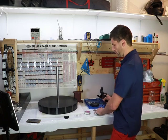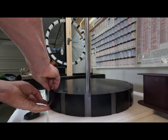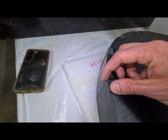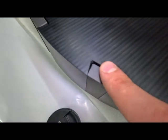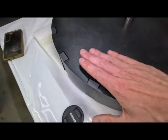It's actually harder to find 3 by 1 inch by half inch magnets than you'd think, so we'll likely have to go the custom route — that's another eight weeks of lead time. Some of the water-jetted ones look really nice; this one here fits beautifully, but others aren't quite the same thickness. This one here is basically bang on. I want them all to be perfectly inset into the rotor.